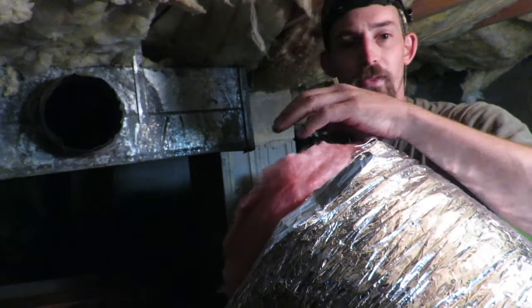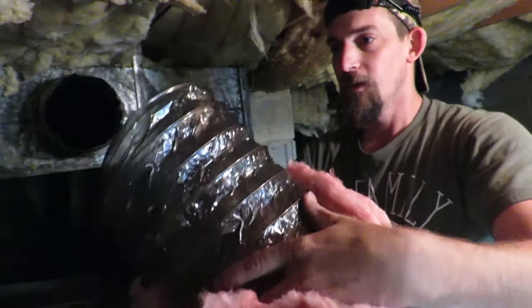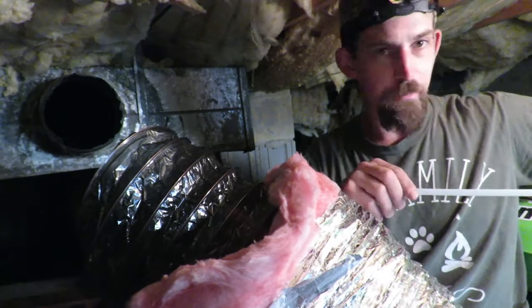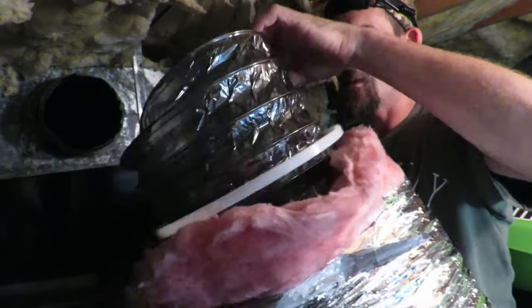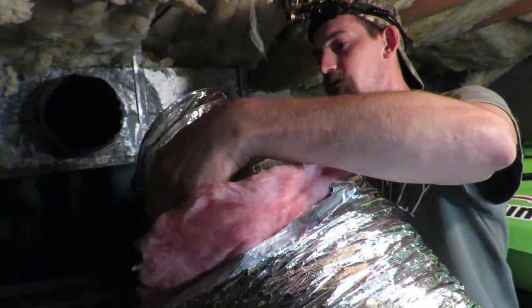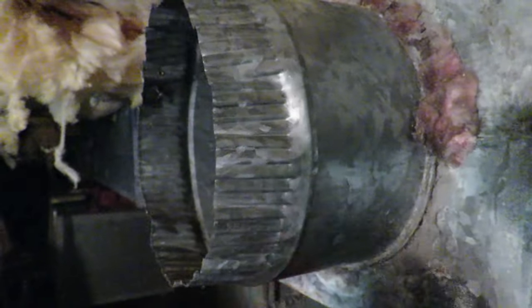You can take the rest of the cut piece and push it back into the box for your next piece. Then your next task is to pull out this flexible ductwork that's right here - that's what we're going to be attaching onto the pipe with one of these zip ties. A good thing to do is get this prepared a little bit, put it around, and get it close to what you need. On your pipe there's a little ridge - you want your zip tie on this side of the ridge so that if it starts to come loose, it gets caught by that ridge and won't pull all the way off.